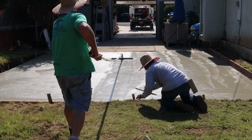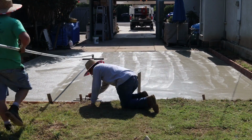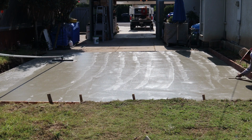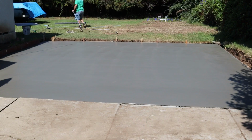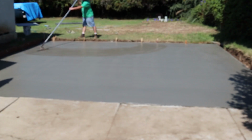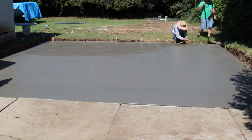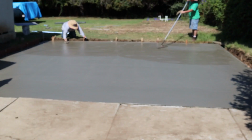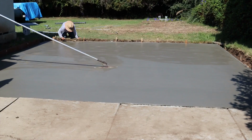And the nice thing about having that rocker on Big Blue, I can extend out probably 6 poles and still get it back without losing it in a burial. In other words, not being able to pull it back or raise it up high enough to pull it back without digging in. That's why you want rockers. Also, you want them so you can really get some more tilt. If the concrete's getting hard, you can tilt it up higher to really burn it in and move some concrete around.